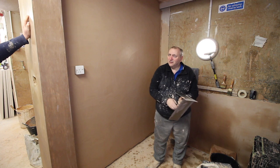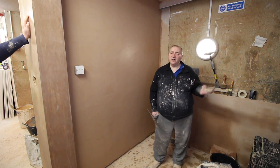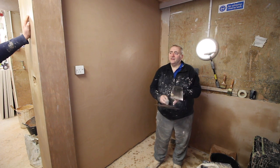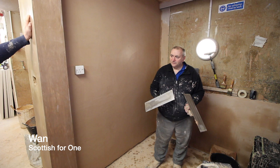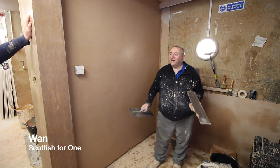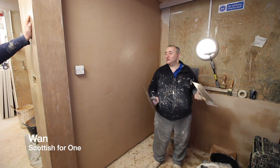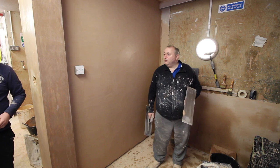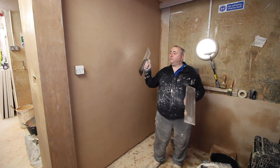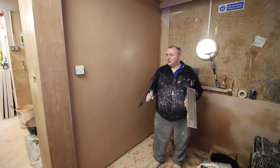You have all got to work inside, basically, so you don't see any joints from that. If it's a wall and there's a couple of you on it, do you stagger it, one at the left hand side and one in the middle, or do you just work from the end? Ideally, if you're doing a big wall each, one's left-handed, one's right-handed, you work towards each other. If you're both right-handed, one starts halfway in the middle and the other at the left-hand side.